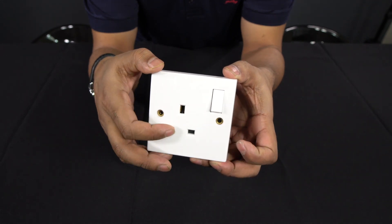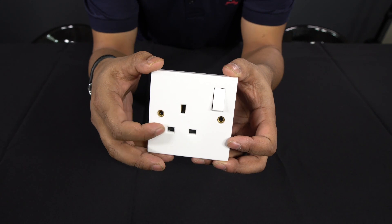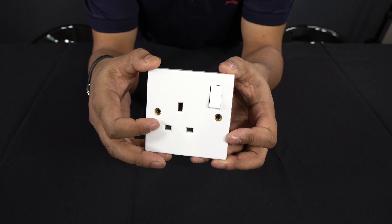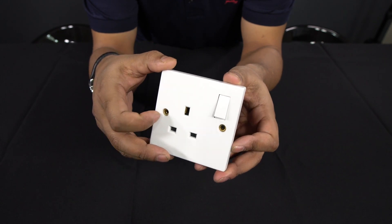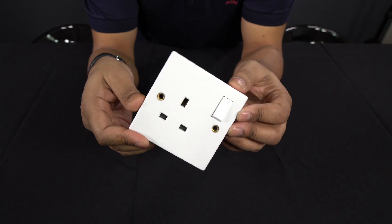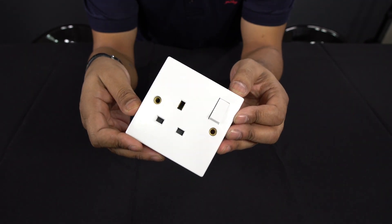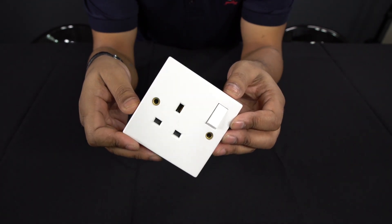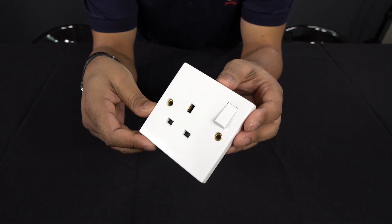The neutral and the live were reversed. Even though it will still operate certain electrical products, it's not really right and it's not really safe. Because the ignition on the gas cooker was based on polarity, that's why it wasn't firing up. I asked him what the device was, had a look at it, and thought I need to share this with people who could benefit from it. If you move into a new house, use it to check all your sockets and it'll save you the headache of thinking your appliances aren't working when it's actually the socket.